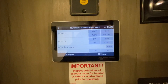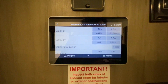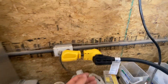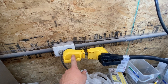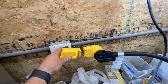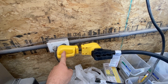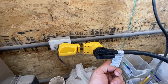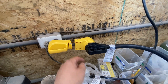What we did was in the VE.Bus configuration we unchecked 'switches group.' The customer put together a special cable — a 50-amp female to 30-amp male with a 115-volt adapter. This does something different than most dog bones: it does not bridge the two hots. It only lets one line in, which is normally what you don't want — except when you're running multiple inverters and keeping split phase in your coach. So you need to make one of these, and that's what they did here, and it's working out great.